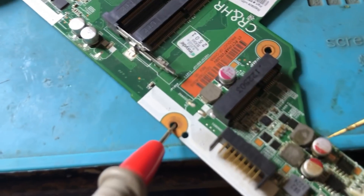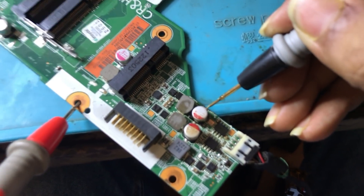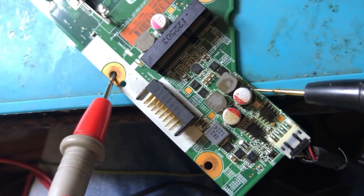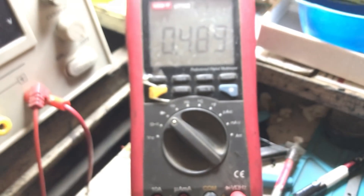If I am trying to check on the capacitor just after the coil, you can see it is shorting — it is beeping over here. And just before the coil we are checking — this is before the line — the impedance is very good.